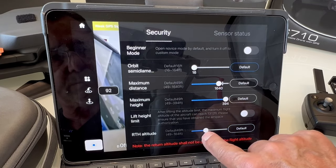Oh, that gimbal is getting hot. And now it's calibrated. So now the satellites know which direction it's pointed, and vertically it knows which is the top and which is the bottom. So anytime you crash it hard or you go somewhere, it'll notify you. But if you crash it, even if it doesn't tell you to recalibrate it, you want to recalibrate the compass.